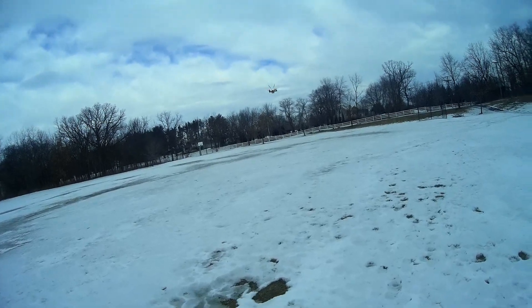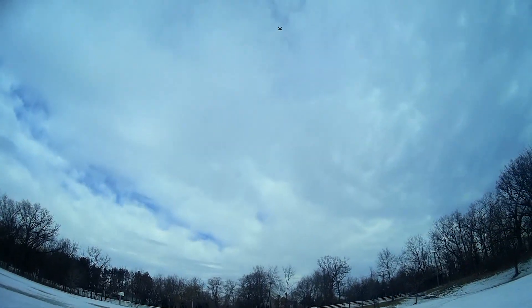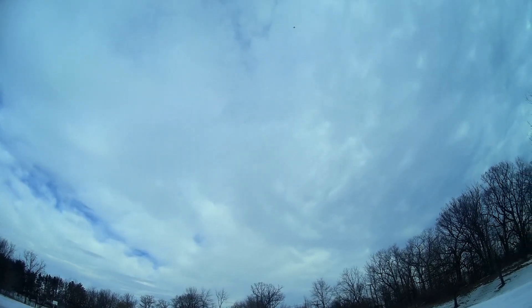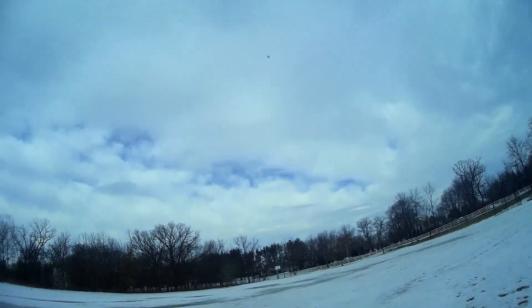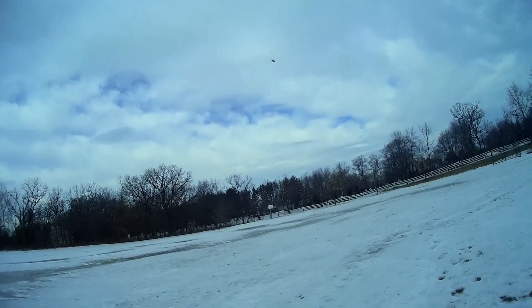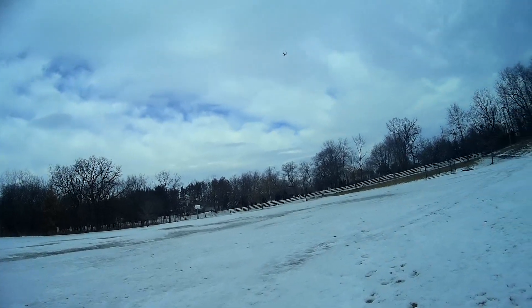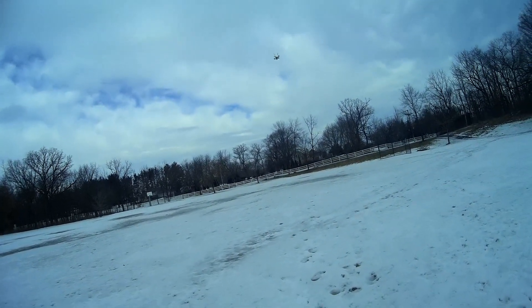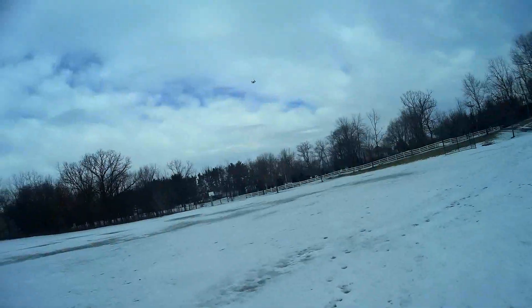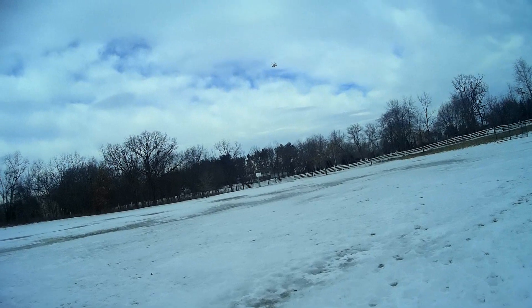More power — about 40 percent. Sending it up. So 35 percent throttle is about neutral. Let's just see what this thing will do. So the propellers stopped when I turned it down to zero. I have OneShot on it — not used to that. When you turn to zero throttle it stops the propellers dead, so you're able to drop the quad faster.